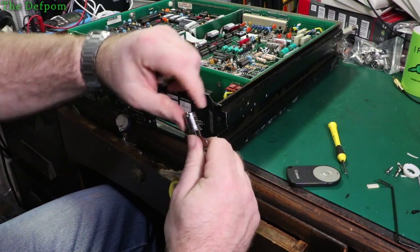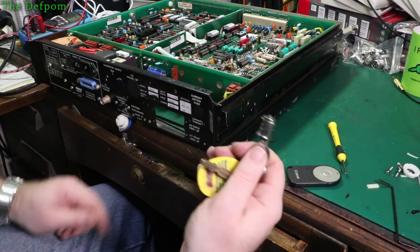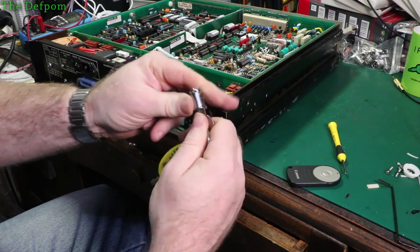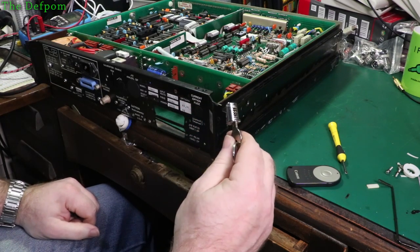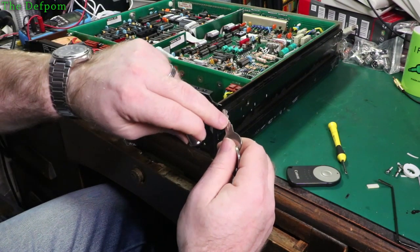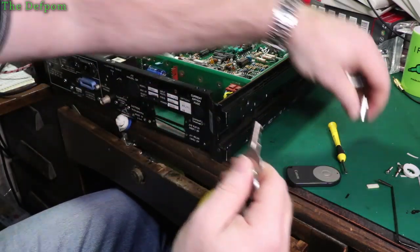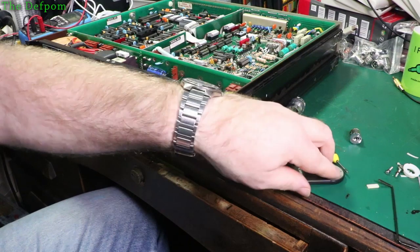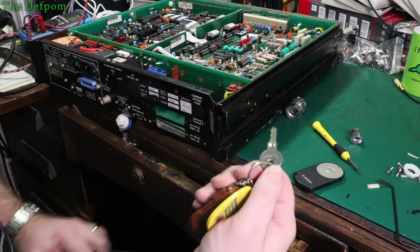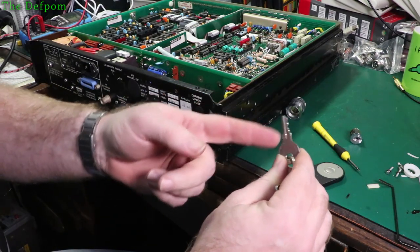I'll put that key right in there - just those two pins there. I could almost just file those off and this key will work, but I'd rather try and keep it intact if I can. If I figure out exactly what the key heights need to be, maybe I could get another one of these particular keys cut, get a spare one done, and then machine my spare key. I might have a key which fits both my Datrons actually. Well, the key fits into the Datron lock but won't turn on my other unit, so it's definitely the right kind of key for these things.